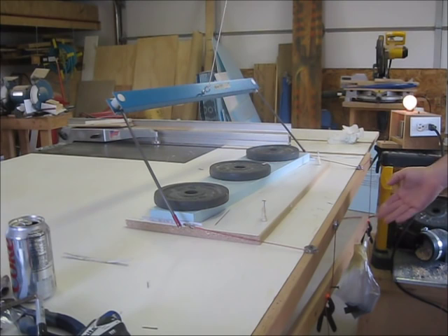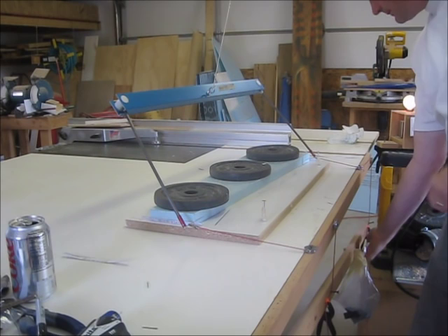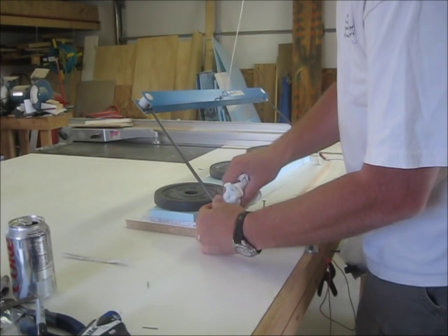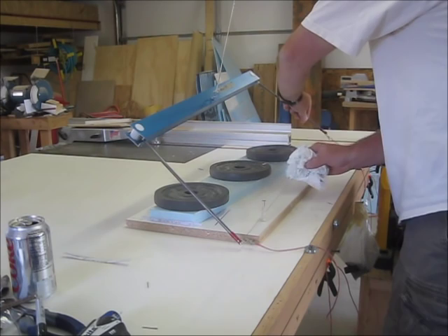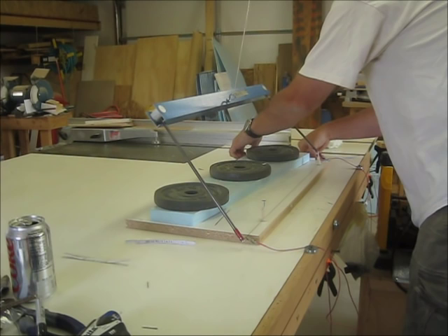It's like watching paint dry. I hope you can see on the video — the arm is falling, pulling these wires at the right rate, each one. I catch it as it comes out. This long one here did come out a little sooner. I try to clean the wire up in between the cuts — it really helps on that leading edge. Powers off, pull the templates.